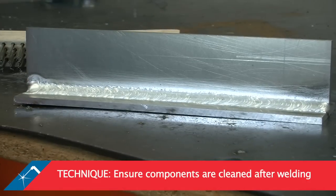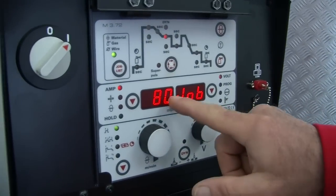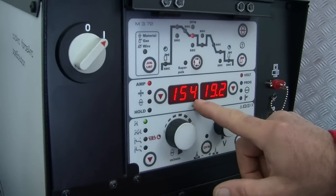Remember that there is no universal setup when it comes to welding aluminium and its alloys. Each machine may need to be specifically tuned by the operator based on the material being welded, the shielding gas mixture being used and any other unique requirements. Variations of heat input can be controlled by the voltage settings of the machine.